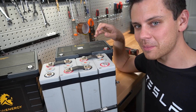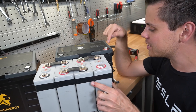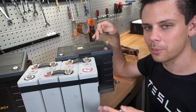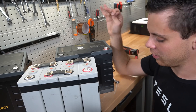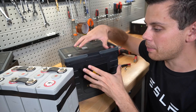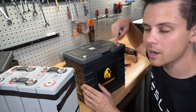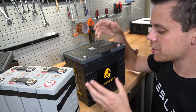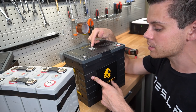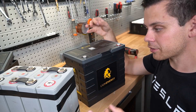That's the point I was trying to make. I would not trust this terminal for large amp loads with high vibration in mobile systems — not at all. Also, what I said about the BattleBorn being a sealed system: that thing is glued and epoxied tight shut, whereas this can be opened up with screws and there is no seal around the top, so moisture can get in. I think my points were pretty valid and well thought out. I've installed these multiple times on multiple systems for over a year and have installed all of these other batteries, so this is from experience.